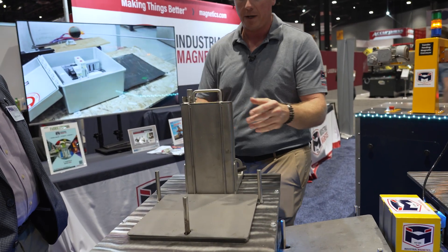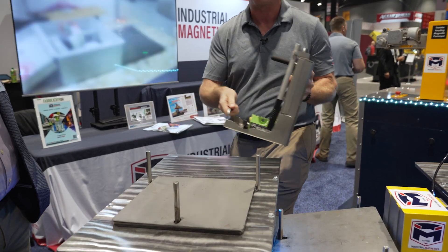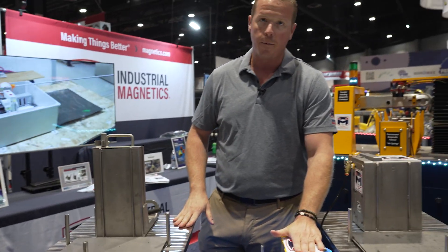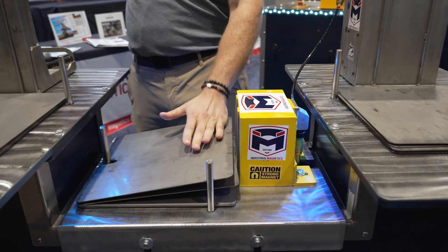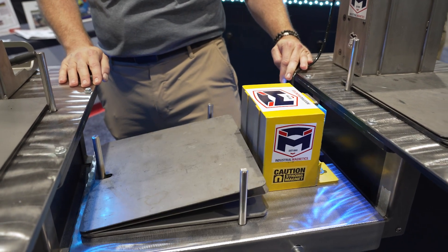The beauty of it is when you're finished with your stack you can move it on to another pin pallet by disengaging the magnetic base and moving it on to another location. The other one is an electromagnet. The advantage here is you can turn it on and off between cycles. If your robot is taking a long time to move the blank, this can be shut off and it can just be sitting still in the meantime while the robot is doing its work.